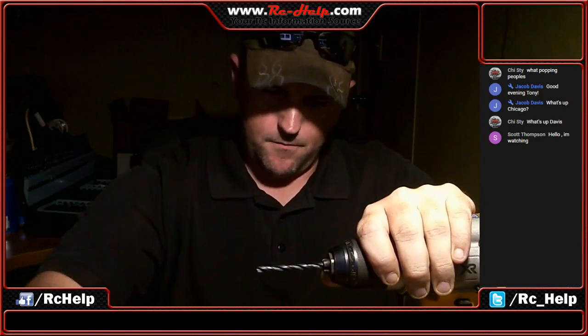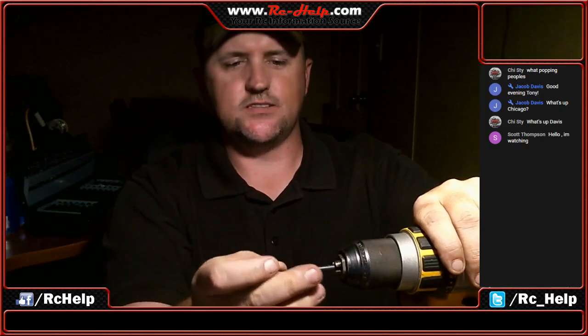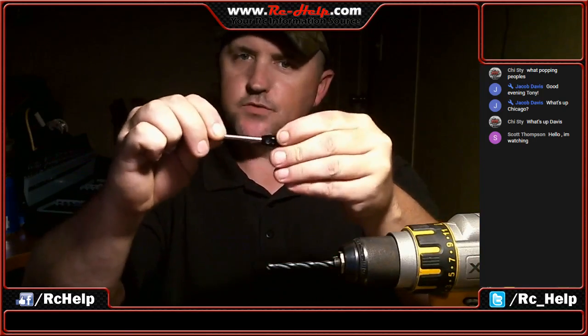Go ahead and pull that out. And now, wrong way, Beavis. We're going to pull that one out, and we're going to go to the 0.199, which is the closest I have to a 5 millimeter bit. Hey now, what are you doing? And again, we can take our main shaft and check it. Still not going in, but it's really close. I can feel it wanting to.